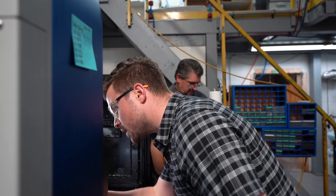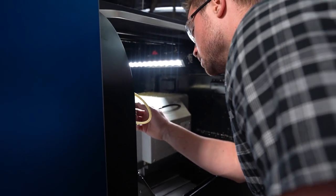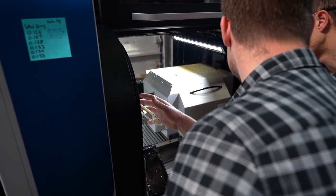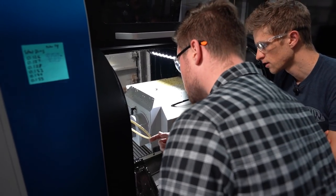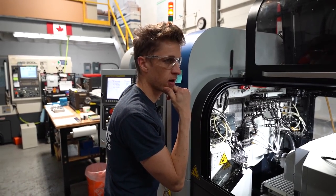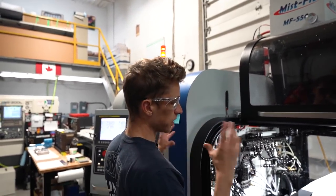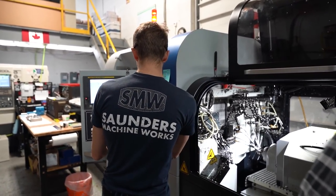So your live tools there. Yep. So you're running an operation on the back. You machine the part, you said the rear end? The rear end, front end? Subspindle. Subspindle, okay, so your subspindle picks it up. And how does it feed it into the live tools? I'll show you. The live tool spindle? Wrap your head around. We have a CNC mill. Okay. Just a manual lathe. So normally a lathe is like two axis or whatever, you know, in, out, up, down. Yep. Swiss is like completely bonkers weird. I gotta be careful I don't bump into anything here, but.